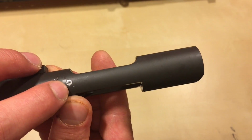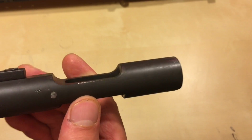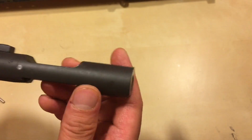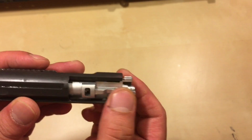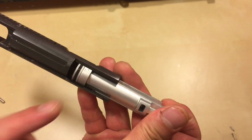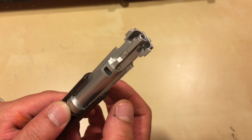Also, this is the retention pin. As you can see, after installing it, they must have hammered it completely flat, because it's wedged in there and there's absolutely no way I can get this out. It's just completely wedged in there, so that's probably going to have to stay in there forever. If this nozzle breaks, or if I need to take it out for whatever reason, I'm going to have to take out the top nozzle guide, the side nozzle guide, pull it out further, remove that O-ring, clamp the rear down, and then twist it in whichever way it comes off, which is a bit annoying.